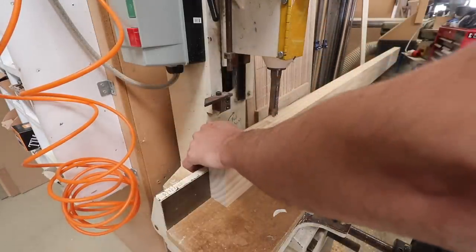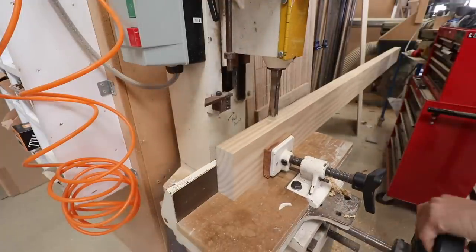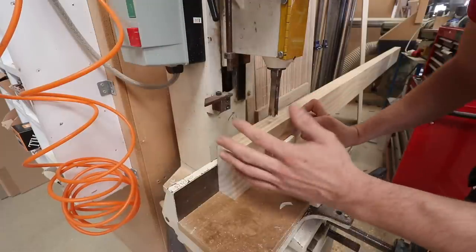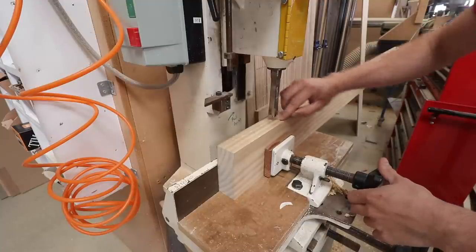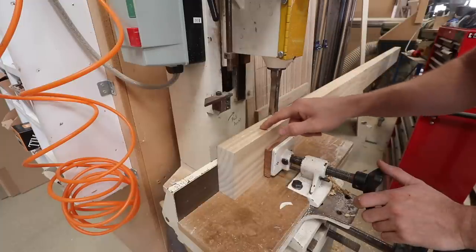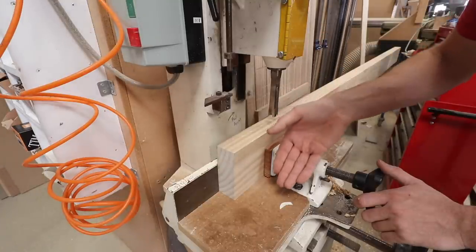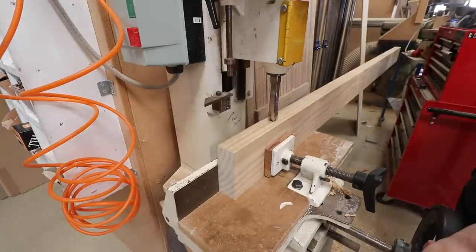Moving that all the way through, because the camera's in the way to hold the piece of timber. Remember, we're going in on these edges first, so where the rails are being wedged up to the inside edge there, which is our reference point, the mortise chisel wants to enter that point first, so there's no deflection. If you cut the mortise away and then do that cut last, your mortise chisel, due to the resistance in the timber, will tend to bend away and it won't mortise up tight to this line.